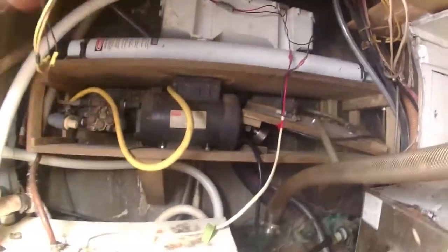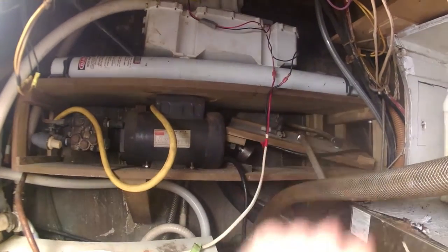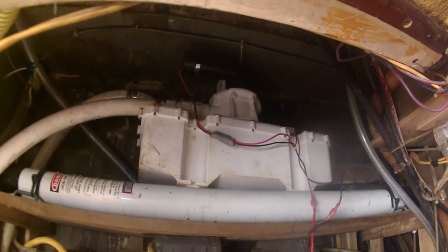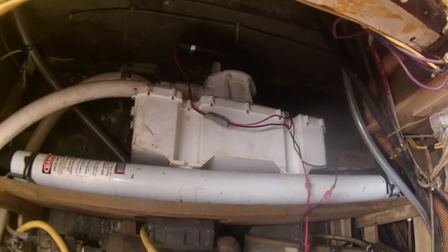More securing still has to go on here. There's our hot water heater — it's had a bunch of re-piping work done to it, and it has some more to do when we get to Panama and can get better hose. There's the water maker right here — these two white tubes up here. The install has got to be finished on that; it's just mounted. And this is the head buddy, part of the aft head sewer system. We've got a vacuum flush in the back, and this is what generates the vacuum for it. It pumps out of the toilet all the way up to there, and then from there we come down into the holding tank or the overboard discharge.